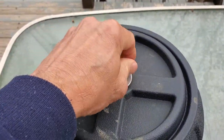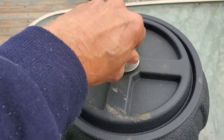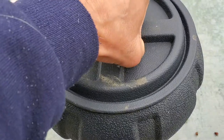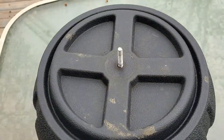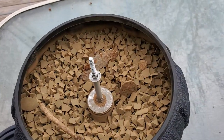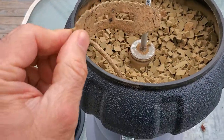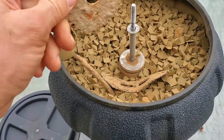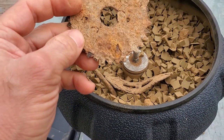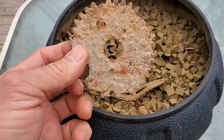Let's see how our pieces are doing after a few hours of vibrating using the abrasive media. We let them vibrate for four hours more or less, and this is how they come out. This is what I wanted — I just wanted to remove the excess rust from each one of the pieces.